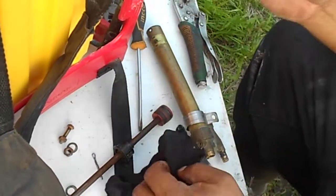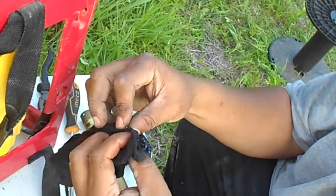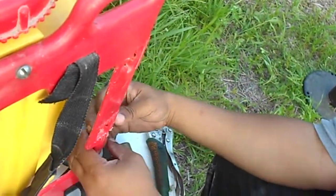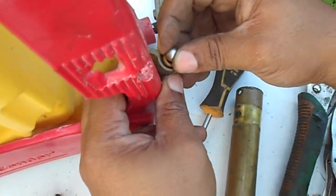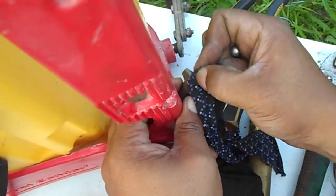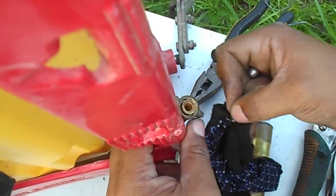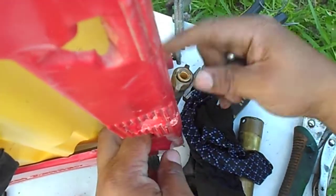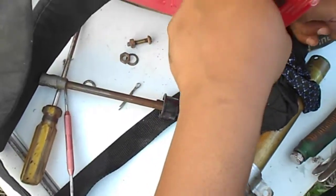Usually the ball bearing itself — if you leave chemicals and let it sit for a while — it will make a bond and get stuck, so it won't be able to move. Therefore it won't be able to suck anything. The tank operates on suction. So it is simply the hardest thing to do at times: to slacken this and get this hose off the pump. I hope I didn't damage it too much.